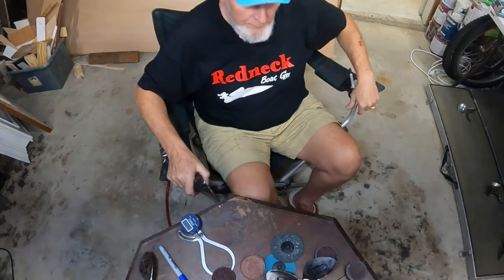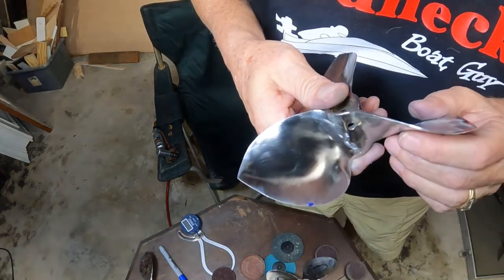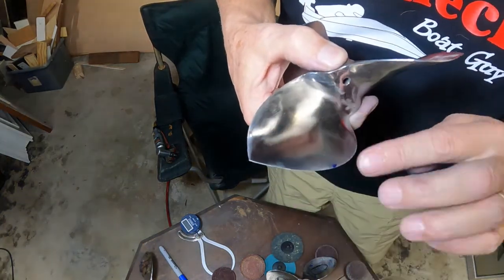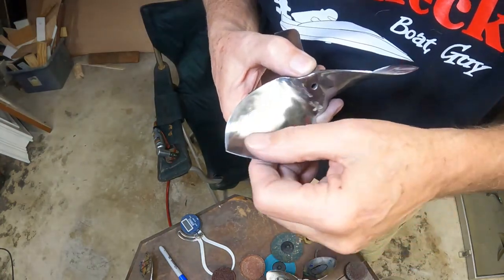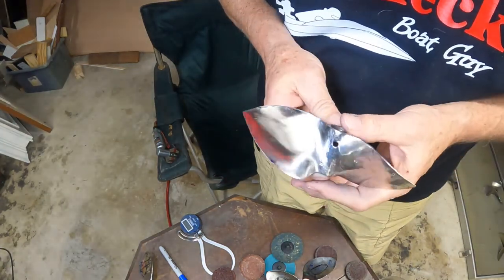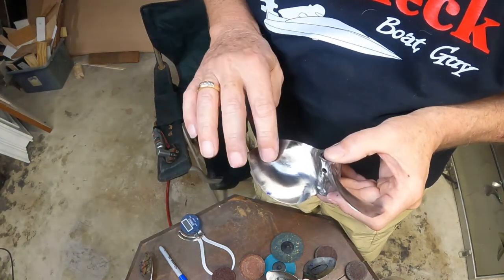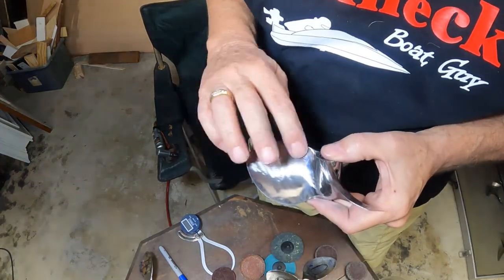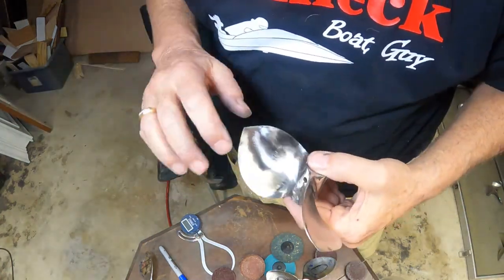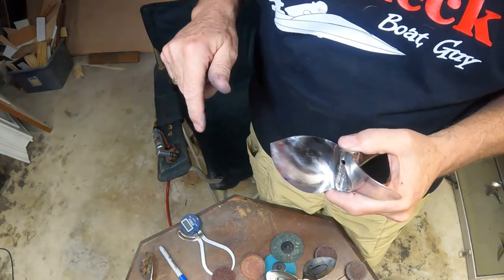As you can see, it's getting a little finer. Still got some lines in it — a little flow pattern there — but this is what I started with and it's a little grittier. It's starting to knock the high spots off with that green pad, and the blades are getting thinner too. I can feel it — feeling better and better. We'll let that air compressor catch up and maybe run it across the grain a little bit to knock those down before we start polishing, so our polishing won't take so long.